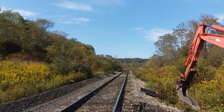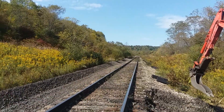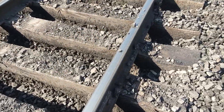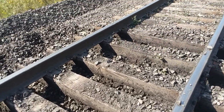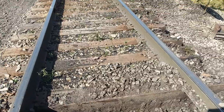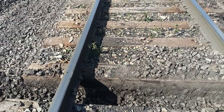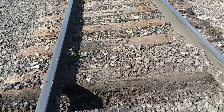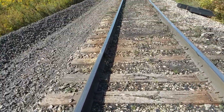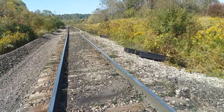This doesn't have a lot of mud in it — what this has is a lot of coal. That's all we haul is coal. If we hauled tanker cars or auto racks or something like that, we wouldn't have all this coal in the track. But coal fines shake out the bottom — we have bottom discharge hopper cars — and coal shakes out through gaps in the doors, and it just plugs the ballast up so there's no drainage. When there's no drainage, water lays in there and you can't hold track surface. It's just a perpetual cycle. So that's why we're doing this, what's called ballast rehabilitation.